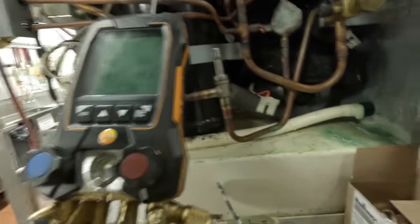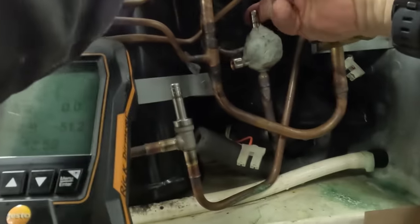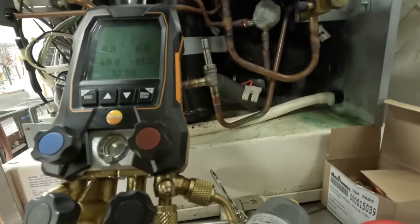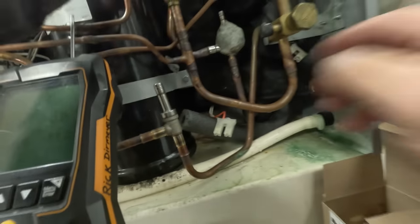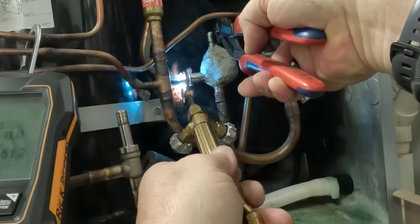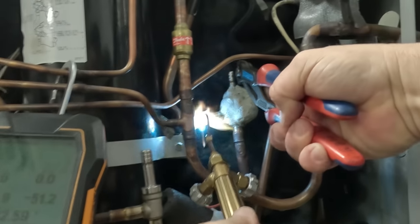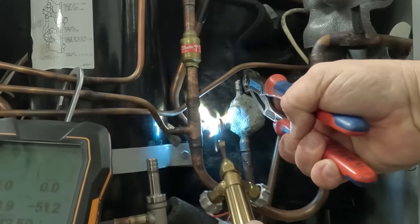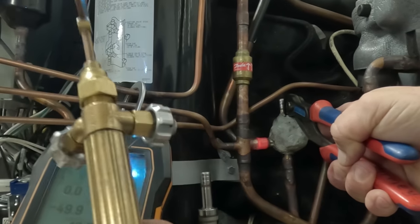I will sometimes bend these pipes towards each other so the tension is towards them — when I put them together and they line up they should feed together fairly decent. Pushing tension on one side, I'm going to try to heat up this upper pipe here so that it goes towards it. Come on baby — I'm going to heat it up a little bit and see if it sucks in.